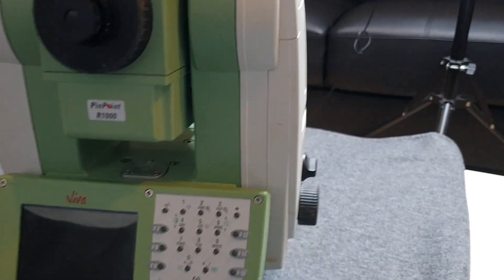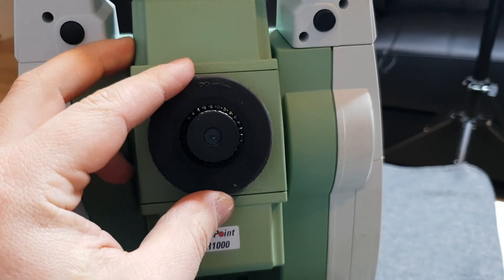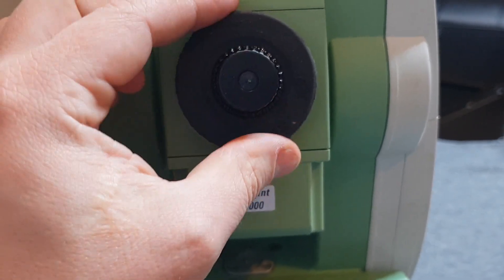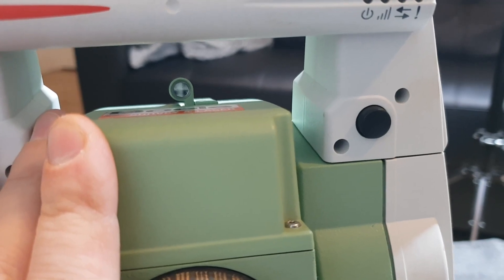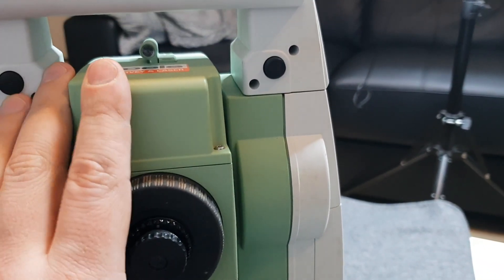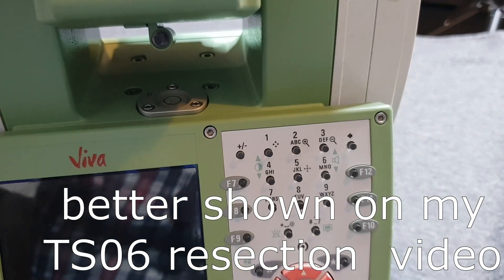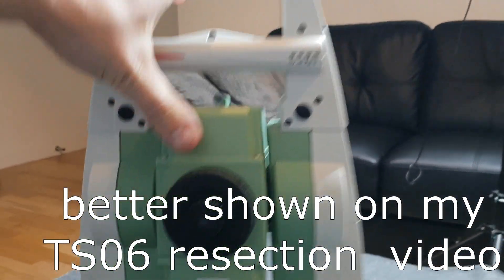What you need to know about the EDM when you start using it: you've got your zoom here, so when you're aiming at targets you move this to zoom in and out. The closer ring adjusts your crosshair to make a clear view of the target. On top you'll normally see two white lines at the cross, which you use from further distance to first aim at the target before zooming in. There's the same cross at the bottom as well, very useful.